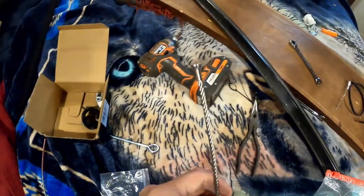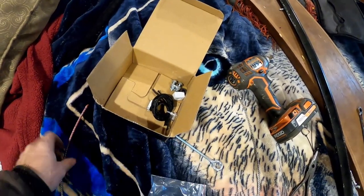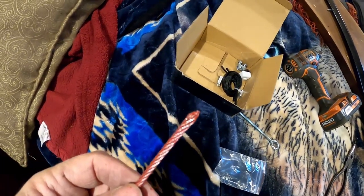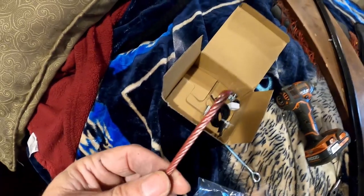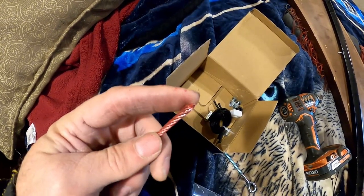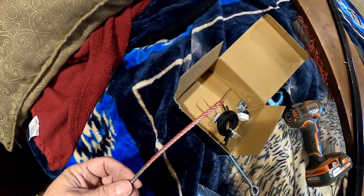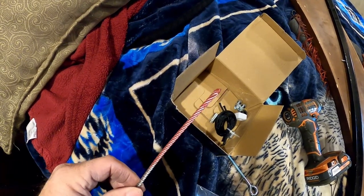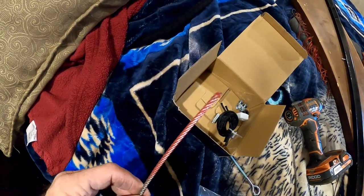So what I've done is I've taken our new cable. I've used the old cable to measure it out, and I cut it to length so I didn't have to deal with that long piece. They give you, at least for this top slide, about 5 times more cable than you need. But I guess you'd need the long one on the bottom. So I've cut that and tried to make it streamlined on top so those individual fibers didn't catch on anything. And I spray painted it red so it might be easier to see. As you'll see in just a moment, our job on the inside is made difficult because we can't see what we're doing. We have to do it all indirectly.